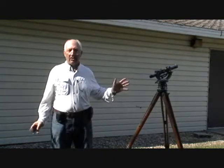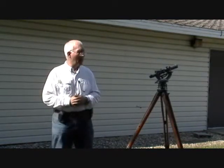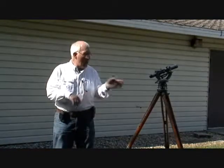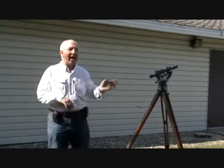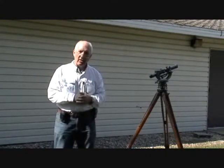These days it's all electronic with GPS positioning and the whole thing, but real surveyors know how to use a device like this. A transit is different than a contractor's level. A contractor's level, you set it so the base is level, and all it does is swing 360 degrees in either direction following the azimuth of the line being viewed through the telescope of the level.